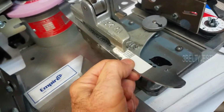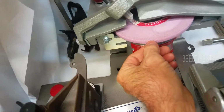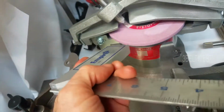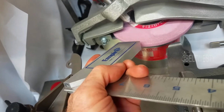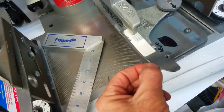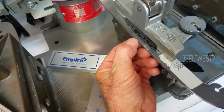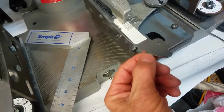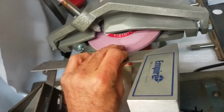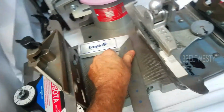If you had this thing grossly off, let's say you had this thing a half inch up, a quarter of an inch up, you still could hit the wheel a little bit high here on the equator, and you still can get even edge thicknesses because exaggerated the blade can be coming down like this. And because it's curved and you're hitting right at the spot, you still can get equal edges. But what happens is the blade from the profile here isn't straight. So if you had it to be right along here with an edge checker, to be the two edges to be equal, you're going to get a curvature error that's going to be your high or low away, and that's because this is not straight through here. Same thing on here. If you went ahead and cut this at an angle, you'll have no error as long as this is straight. But skates are not straight.